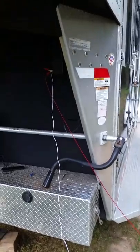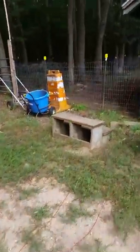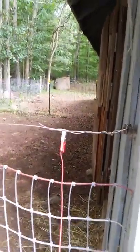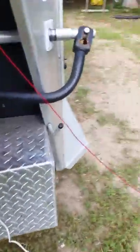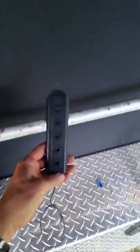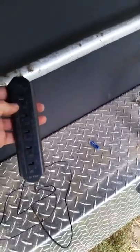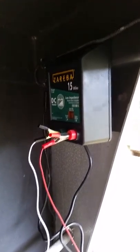For my testing here at the house, I went ahead and connected it into the electric fence on the entire farm. That DC fence charger has been running for about the last 20 hours. You can see the line running all the way over to where I've got it clamped onto the electric fence. I used a standard tester before I hooked it up — just a basic fence tester where you stick the end down into the ground and check how many lights you're getting for output. I tested it with my full 25 mile AC charger first, and then with this DC charger afterwards, and I'm getting the same amount of charge onto the fence with just the DC charger compared to the AC charger.